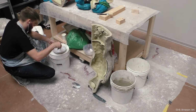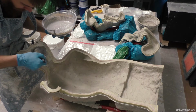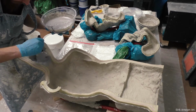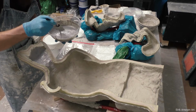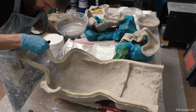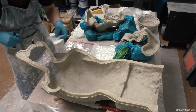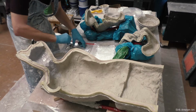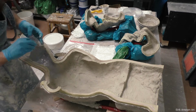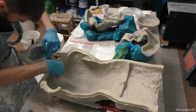Before I even begin, I've already cut the fiberglass into squares or rectangles that will fit my sculpture. Cutting fiber while laying them down I think is a very bad idea. It usually turns into a mess, your resin sets up on you, you get rushed, your scissors get caked in resin, which will in turn flay your knuckles. Just trust me, it's a bad idea. So the fiber is pre-cut. Get a good pair of scissors and try not to rip and tear the fiber, as this kicks up fiberglass dust. You can wear a mask if you want, and definitely wear gloves. Nothing is more annoying than tiny pieces of fiberglass stuck in between your fingers.